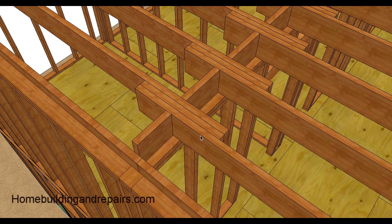I have a block in here because the roof rafters line up. If I just lapped the rafters it wouldn't work out with the roof rafters lining up. So this is a helpful tip you don't see a lot — some people will move the ceiling joist or angle them slightly. But sometimes a block like this will work out just fine and make everything line up nicely.